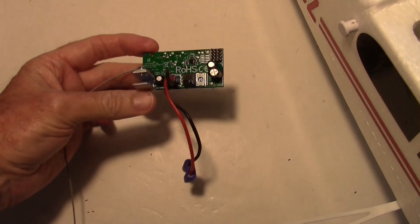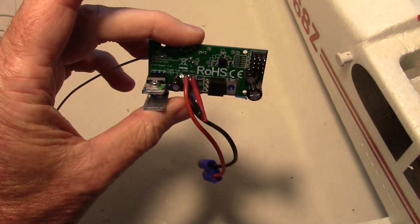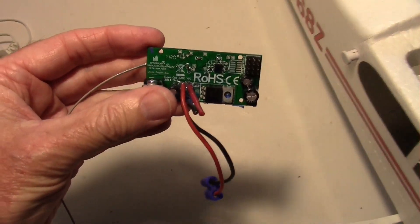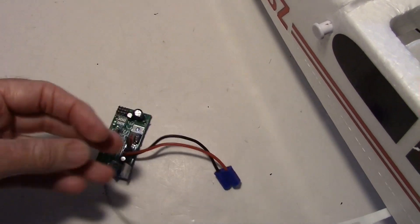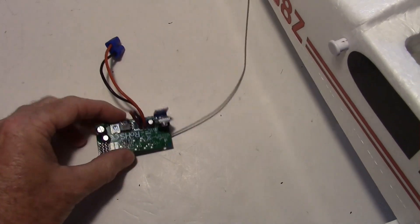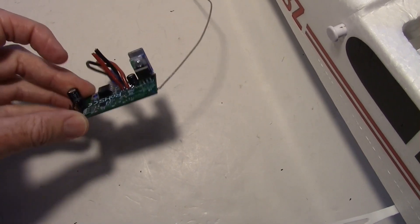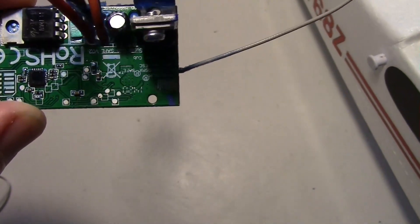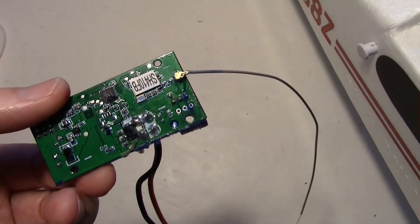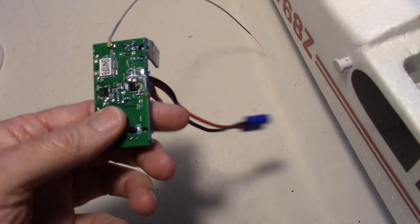This is the controller that was in the plane — the SAFE technology. I've cut the wires off right here that went out to the motor. It's a brushed motor and I replaced it with a brushed ESC. The original controller is kind of an all-in-one board: a 2.4 gigahertz Spektrum radio control with a big transistor for controlling the motor. That little bitty chip right there is the flight controller, and there's another one on the bottom. I took it out and put more modern technology in.